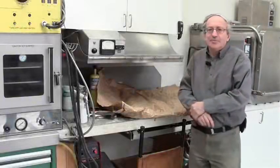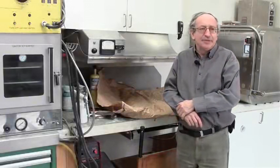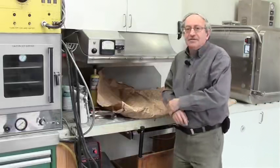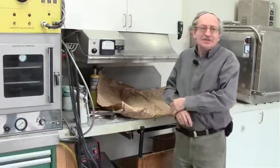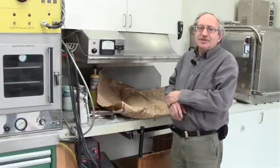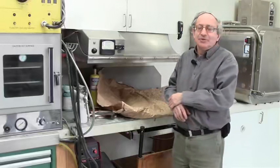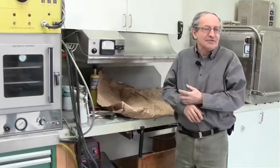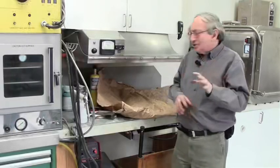Okay, so this is a painting and welding area, but before we get into painting, let's talk a little bit about surface preparation. So the paint or adhesive sticks to the metal by a combination of a mechanical and chemical effect. So mechanically, if there is roughness on the surface, it locks in mechanically, but a lot of the bonding comes from a chemical effect, some of it through the surface energy, which is released of the surface, some of it through true chemical bonding, like for example when you bond glass with silicone rubber adhesives and so on, in some adhesive you form a true bond and get a tenacious bond. So we'll talk separately about bonding, so let's just talk about painting.